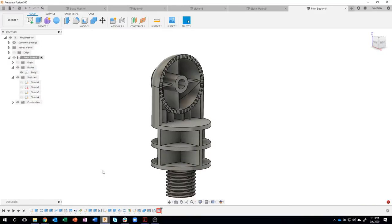My fillet errors out. I get a warning message that just says error, and you'll notice that none of these fillets showed up, and this is red. Okay. This happens all the time with customers that I'm helping out with. They'll be like, why did this not work? Well, in this case, it's because there's all those little teeth and there's all these little edges that were selected, and now they're kind of like overlapped by these teeth.